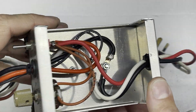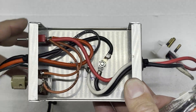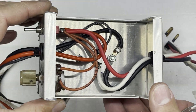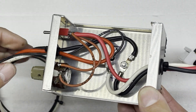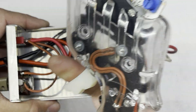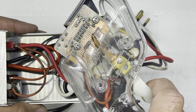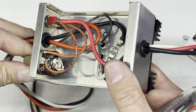At the start of the video I said we'd also discuss modifications we're going to make to this controller. One thing we could add is what we call anti-brake. Anti-brake is a fairly modern feature because certain motor types are now becoming incredibly brakey - the moment you lift off the controller they almost stop dead, making the car very hard to drive. Anti-brake puts some power back into the motor so it doesn't totally short out, and it carries on driving the motor for a short period after you've braked, keeping the motor going slowly rather than stopping abruptly.